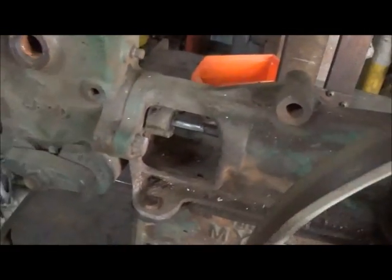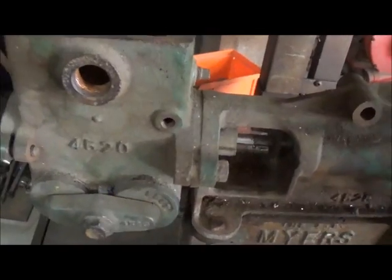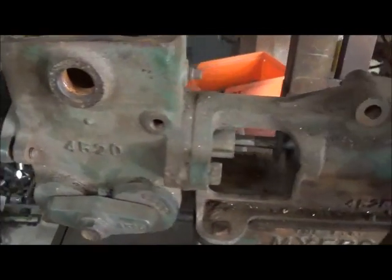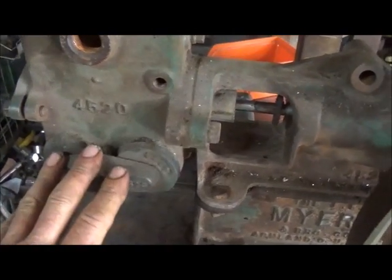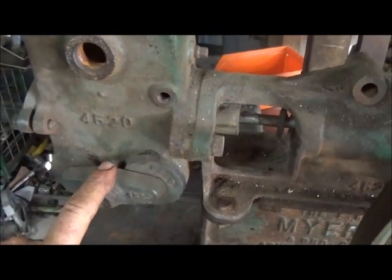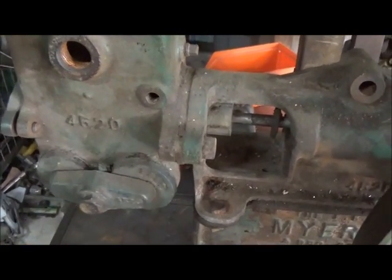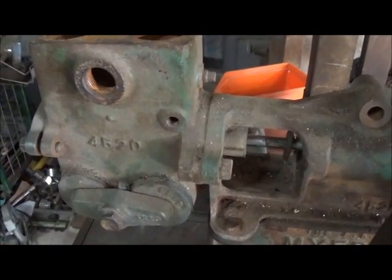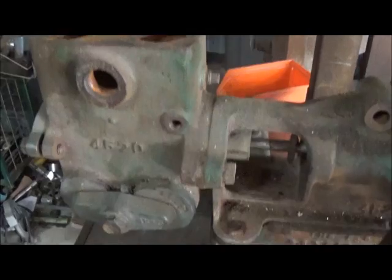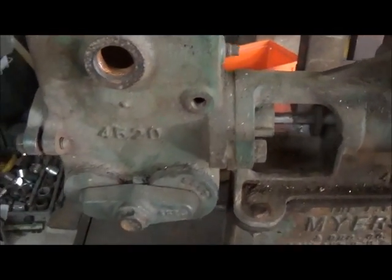This is a good smooth runner. It's about a two-inch stroke on this one and it's got a bigger piston than the other one, so maybe we'll get a little more power out of it. I'm going to go ahead and get these valves out and get it taken apart. I've had them out before, made new gaskets and everything, but we're going to take them back out and see what we need to do about machining it and capping them off.